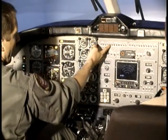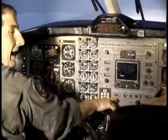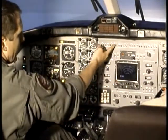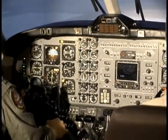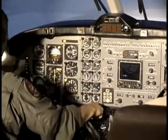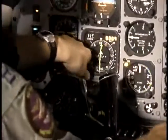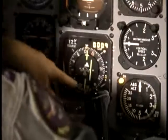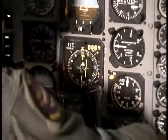So that brings us up to our VOR1. So I'm going to go ahead and flip that up. And remember, we've got the ILS dialed in, so we should be hearing that ident. And I'll also bring up the marker beacon on that side. So we've got the ident, and I'm going to make sure my nav one is selected. And what I'm looking for when I go to test for a localizer frequency, you can hear the audible marker beacon, as well as 1.5 dots right and 1.5 dots down on the glide.